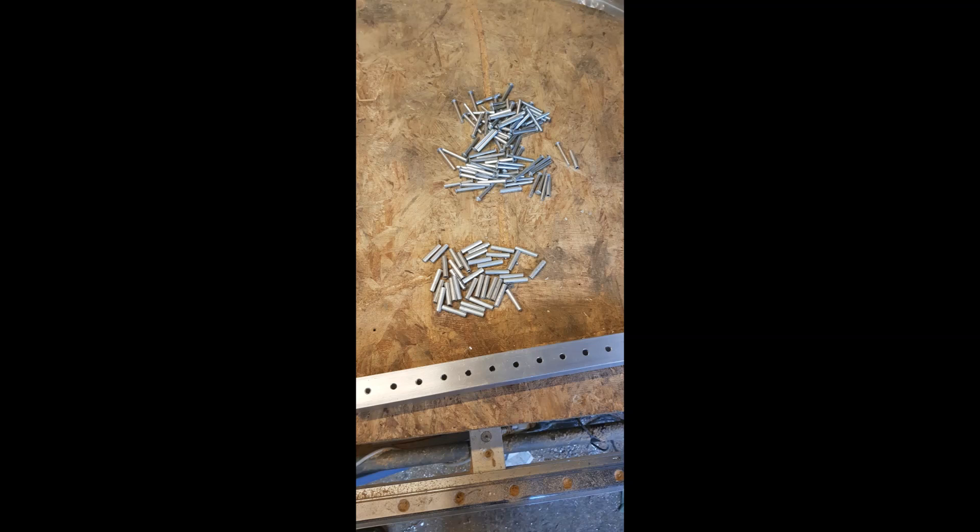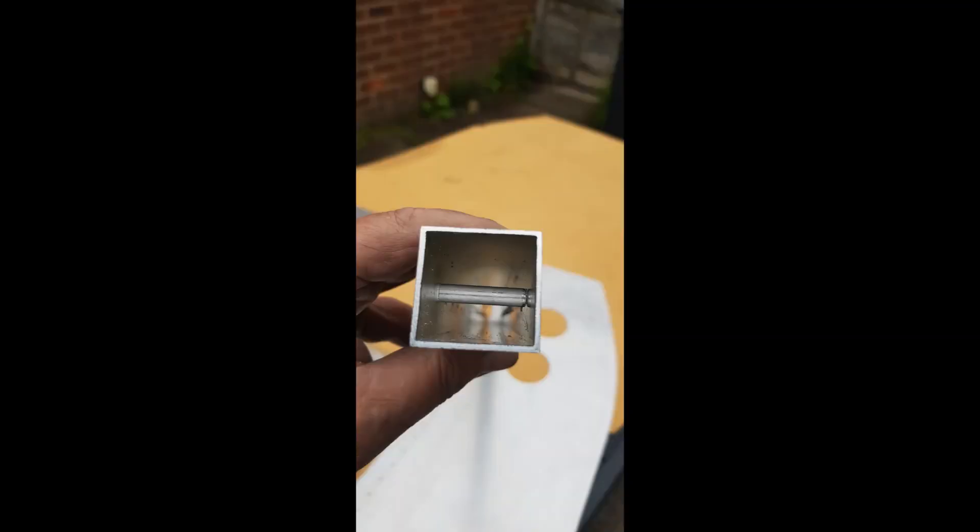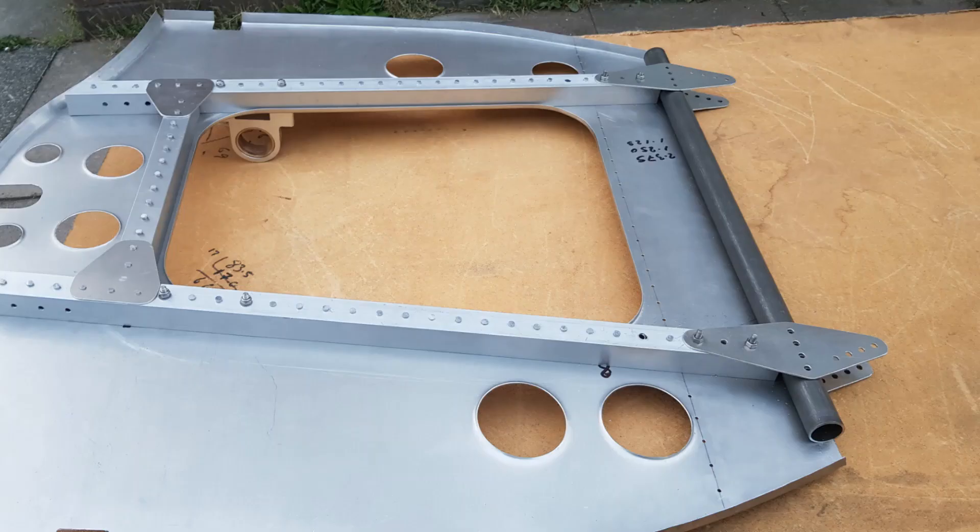As both the distance tubes and rivets are no longer available, these parts have all had to be made in-house. Image 13 shows a cross section of the chassis member with the distance pieces fitted. Image 14 shows the completed bulkhead and box chassis riveted together, with the base rail and fish plates for the rollover crash pylon support also visible, as are the pilot seat torque tube brackets fixed through the chassis.